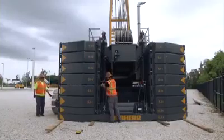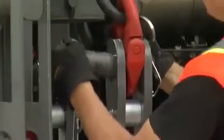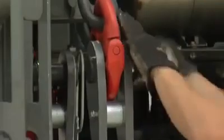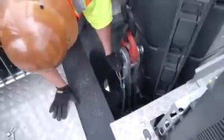The cylinder should already be in the lowest position. Connect the chains to the rear counterweight using pins. When lifting the counterweight, ensure it is in a horizontal position. Secure the rear counterweight with pins and actuate the mechanical locking device.